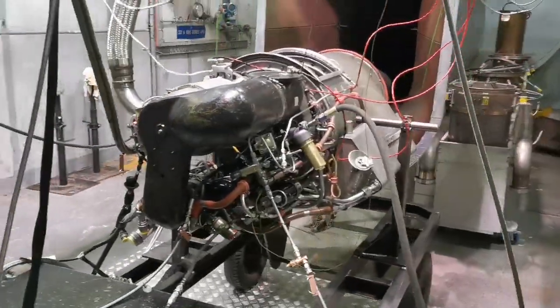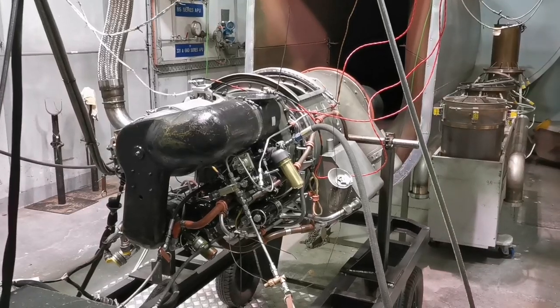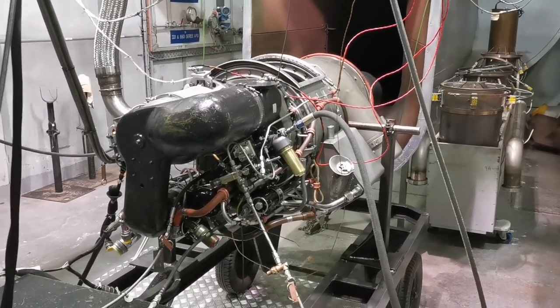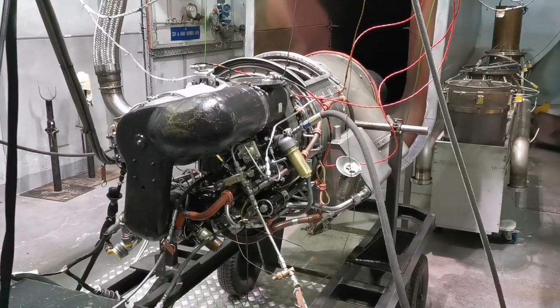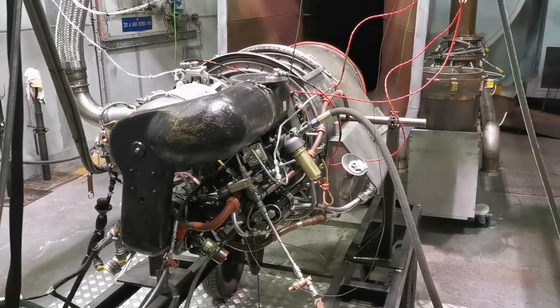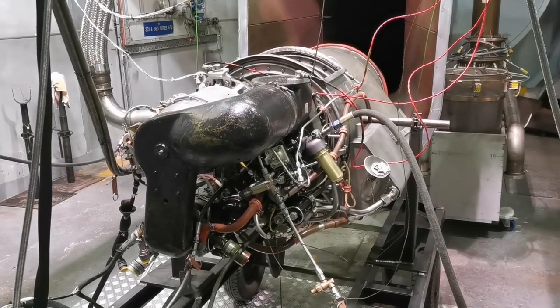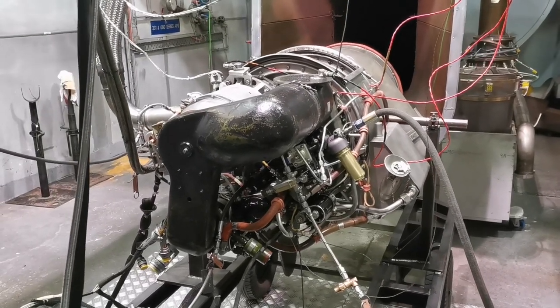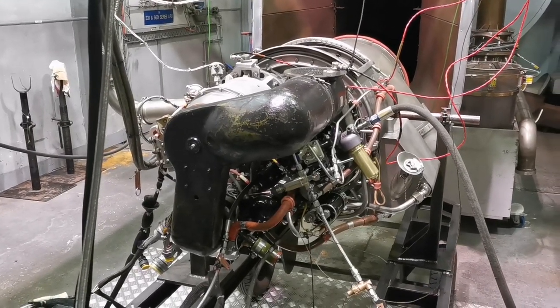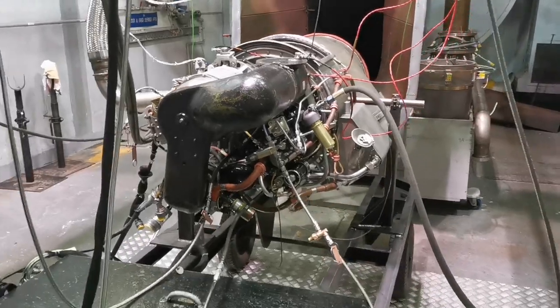Okay, so it's motoring down now, and they're air-shatteringly loud. Now, that was it without putting any sort of pneumatic or electrical load on it. That was basically idle. APUs tend to operate at 100% RPM all the time. I think the RPM on these is, if I'm not mistaken, 44,000 RPM. So they spin fast as well.